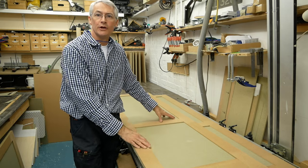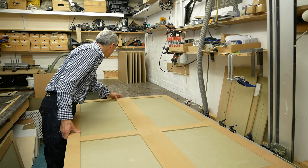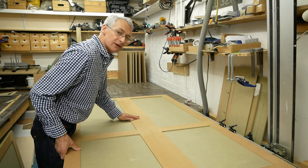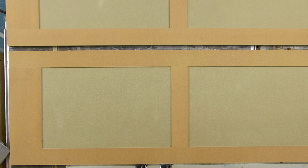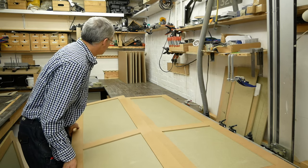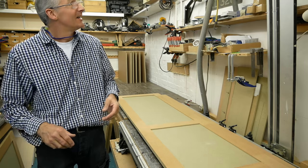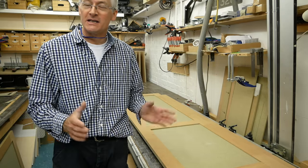One of the things you will want to do when you've got a pair of doors like this is just to set them up against each other. First of all to make sure they're both the same length once they've been trimmed — they're fine — but also to check where the stiles meet. There's a teensy little gap in the centre; one of them or both of them is very slightly bowed, very slightly curved. So we'll just trim that back to make them straight, because it's one of those little details that you don't necessarily see while you're making the doors, but when you've got them up and hanging, there's nothing much you can do once they're painted — you've just got to take them off and cut them back, which is a real drag. So we'll just trim those down now and get them meeting nice and flush.